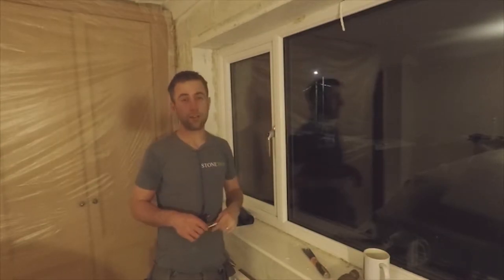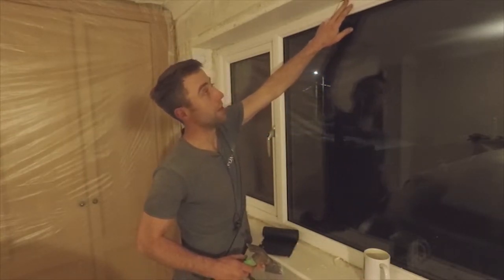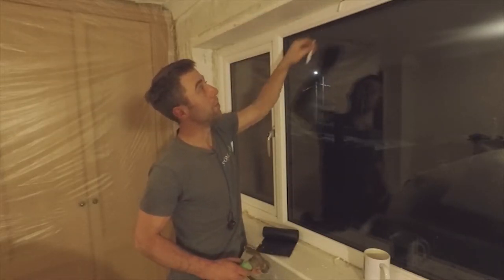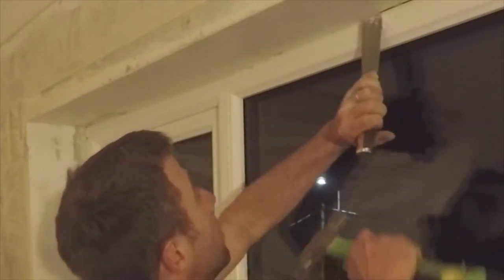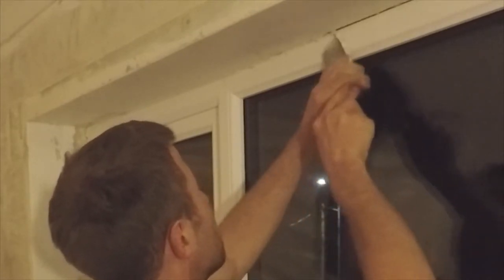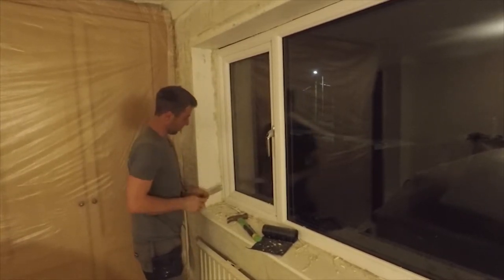So let's get down to it. The first bit is around the windows — I like the plaster to go right up to the windows, none of this sealant stuff that ends up perishing over a couple of years. Around the windows, all we need to do is chip it away. What we want is a good key for the new plaster to get into. Chisel out at least a centimetre, getting on for half an inch.